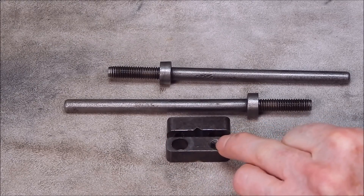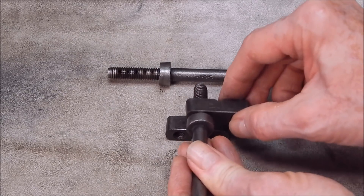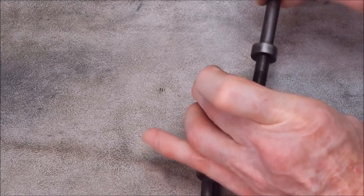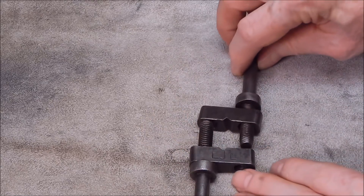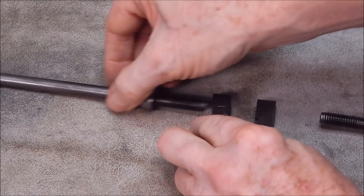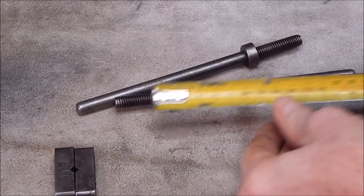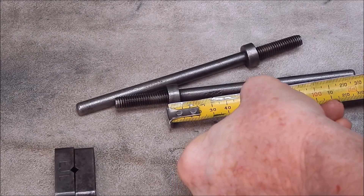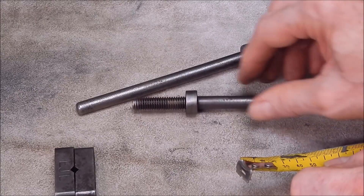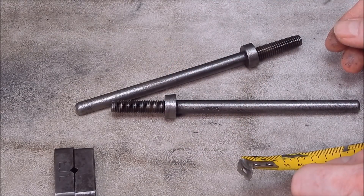As you can see, it's just so simple — a hole straight through and a threaded hole. Your threaded section goes through the hole, and then it just screws into the thread on the other block, and the second one comes in the same way. You can see the way the whole thing goes together — just four components. If you want some basic measurements: 40mm thread, 10mm collar, 125mm handle. You could easily knurl that, or make it a bigger diameter so you get a better grip and it doesn't dig into your fingers as much.